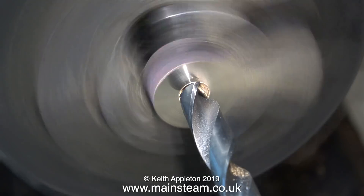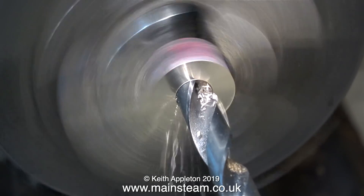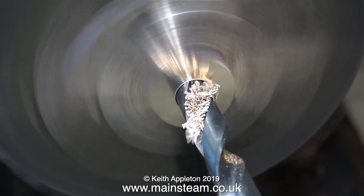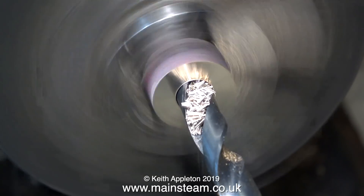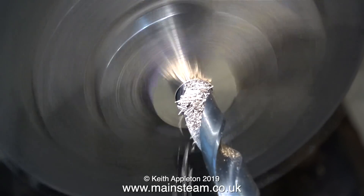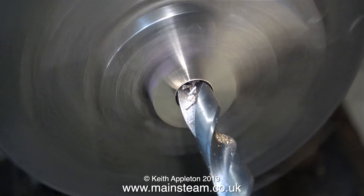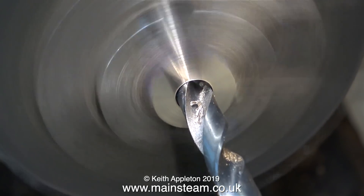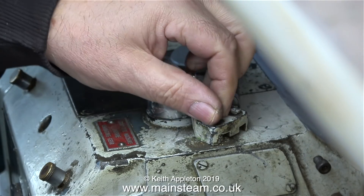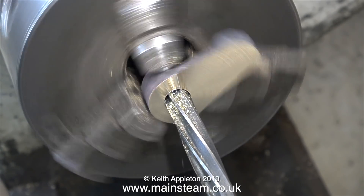It is vital in this operation to drill and ream a hole in the centre of this crank web at a perfect 90 degrees to the face. In this clip I'm using a twist drill one Imperial size less than 3/8 inch. The hole needs to be 3/8 of an inch in diameter, so I'm using one size less so I can use a reamer to accurately size the hole. Before using the reamer I need to slow the lathe down — I'm switching it into back gear and the chuck is now revolving much slower.